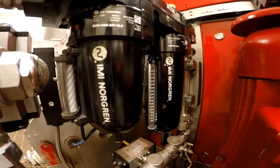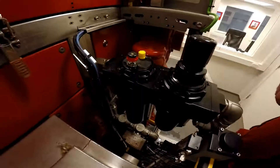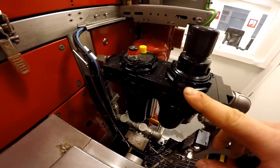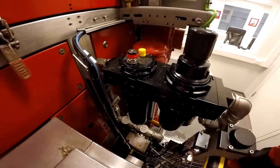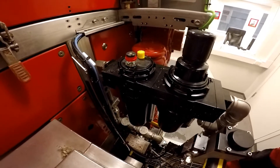This is also where you can gauge the oil level on both of them — the other one is the water. The drips should be six seconds for eight vibrators and four seconds for twelve. Just adjust if needed.